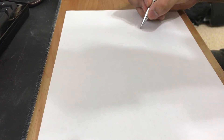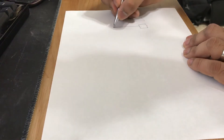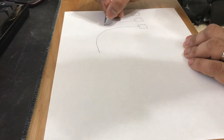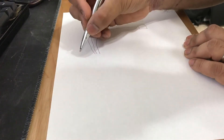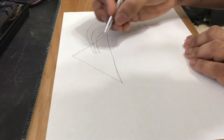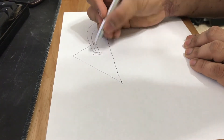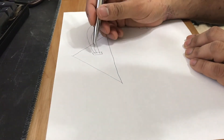Now the key to making this project work out is to make sure that we have it all planned out on paper first before we go out and buy anything. So here's the plan. We have all these rooms — I'm going to indicate three of these rooms. I have Ethernet cable going into the attic from all these rooms. What I'm going to do is put a patch panel in the attic to indicate which port goes to which room, and I'm going to have them labeled.